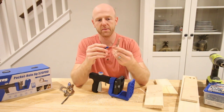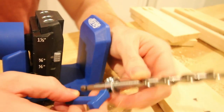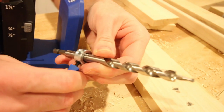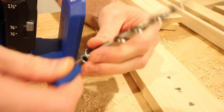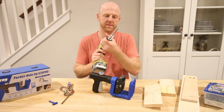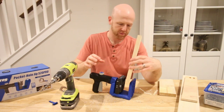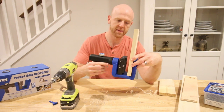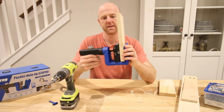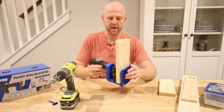This is a three quarter inch piece of wood. You need to do two things on the stop collar on your drill bit — use the little hex wrench that comes with it, slide this into the three quarter inch position, and tighten it into place. Drill bit's ready to go. We already did the squeeze to adjust the thickness on the drill guide. So here's our wood — we're going to put this into the clamp and squeeze until the drill guide comes into contact and it's nice and secure, not going anywhere.